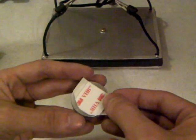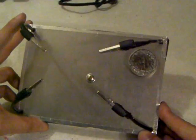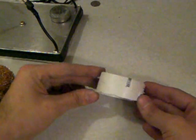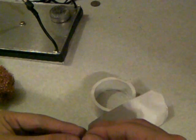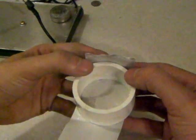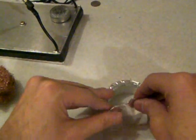Next, grab this adhesive tape made by 3M — they're very durable. We're going to use this and put it onto our tip and solder cleaning tool, which you can buy for a dollar fifty at Radio Shack, and put that onto our board. Now the cleaning solution and cleaning tip are in the right position. We then got an old piece of PVC pipe and are going to put aluminum tape on the bottom part because that's where we're going to put our cleaning sponge. Make sure the aluminum tape covers the entire edge over the PVC pipe so your solder isn't burning onto the plastic.